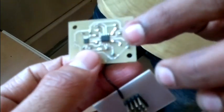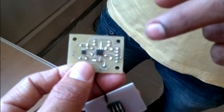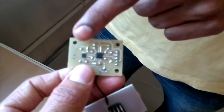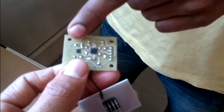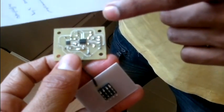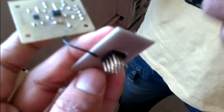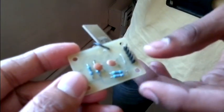This amplifier includes a voltage follower that provides a high input impedance so that there is no loading of the signal. This voltage follower is followed by an instrumentation amplifier INA333 that provides a gain of around 800. The INA333 is followed by a stage of inverting amplifier using OPA333 that provides a further gain of 5. This also acts as a low-pass filter, as we have implemented a Sallen-Key second-order low-pass filter in this PCB.